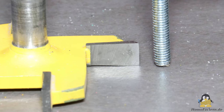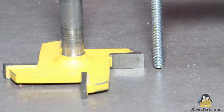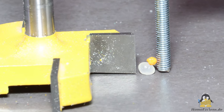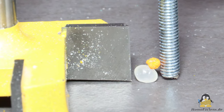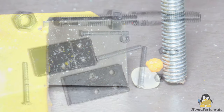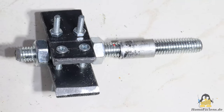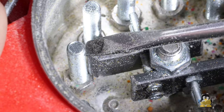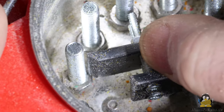I have built and tested various grinders to optimize the efficiency of the process. In the first video I processed the pellets with a sharp-edged cutter, and at the end I suggested changing the dimensions towards a wider cutting edge. In practice however, this only leads to a small increase in material throughput, since ultimately only the largest particle between the stator and the blade is processed, so making it very wide makes little sense. I experimented with rotors made of flat steel — this works, but no miracles are achieved. The screws used as the stator and the rotor shaft are not ideally hard, which causes them to bend when the granules are hammered.